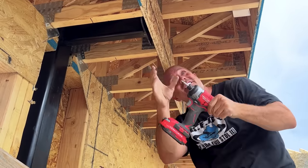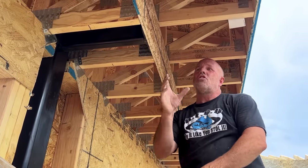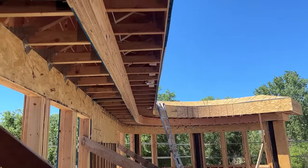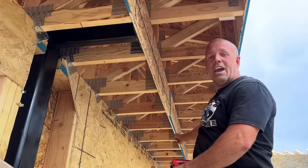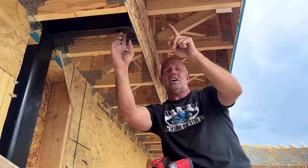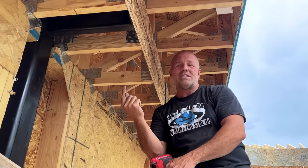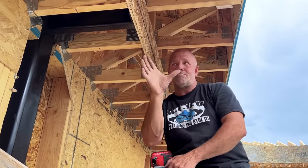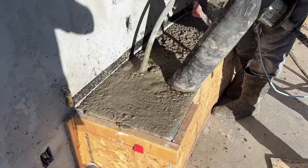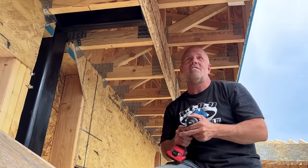I used my drill as a hammer. Slide that into place. I'll put a couple screws in it. Then afterwards I'll layer this. Right now this is OSB — it doesn't have much strength, it's used for walls and roofing. But I want to bring this out to five inches thick to create the beam that goes from this steel post to the one nine feet away — nine feet all the way around this whole wall. I'll put CDX half-inch layers until I get five inches thick, then put eight-inch bolts through it, bolt this beam to this side, do the same on the other side. Once this whole thing's built, sheeted, and both side beams built to five inches and bolted, I'll double-check all the levels, burn these welds out, and pour concrete in the legs on the side and the benches all in one with all the rebar. Four down, four to go.